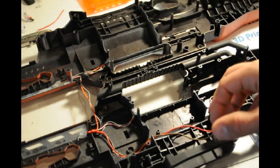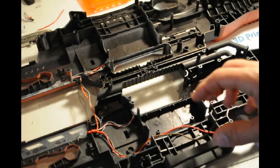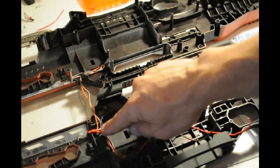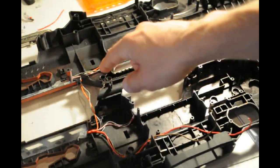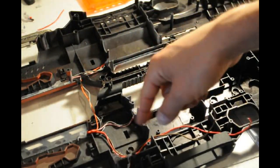I'm using an 11.1 volt LiPo. It'll charge up to 12 volts, so it's quite a bit going through there. But anyhow, I pulled all the stuff out and rewired it with some white LEDs that are actually much brighter, so I'll get a better flash in that muzzle: that clear orange jam door, and then a white muzzle flash. It should look pretty cool there. Then I got them all hot glued in place and wired.